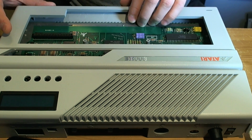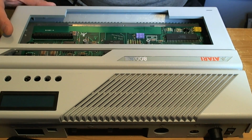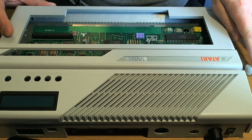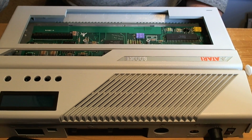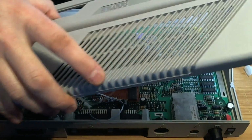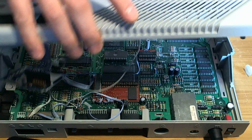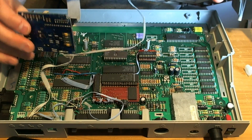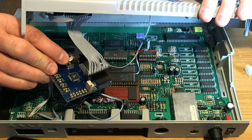There ensued on Saturday evening a virtual machine setup on a Windows 10 PC with Windows 7 to try and get PonyProg 64 to work, trying to install drivers for the AVR cable. Nothing worked. And as I was trying to connect this cable to this board with a 6-pin header, it occurred to me, does the board work at all?